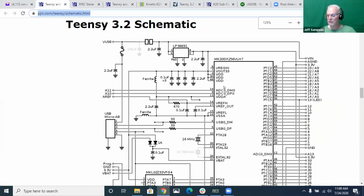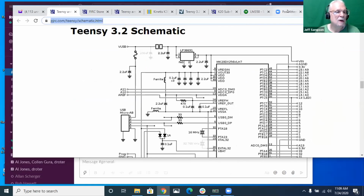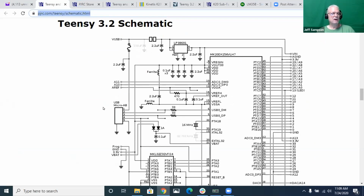Now, it turns out if you go to something like, do I have that one up here? At one point, I had a schematic up for the Arduino Nano, and I believe the Arduino Nano does have a diode between their incoming power and the regulator, but then they also just have the wire going externally, so you've got a direct connection again. So even in that case, you should add an external diode if you're going to power it externally and still be able to walk up and plug in the USB to reprogram your TNC Nano.